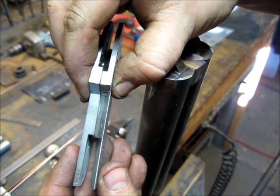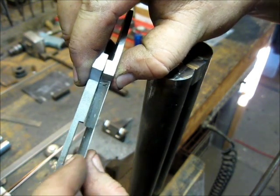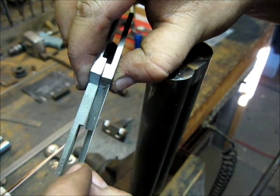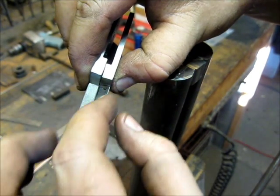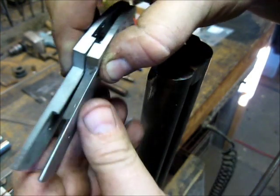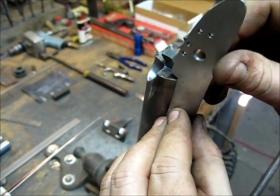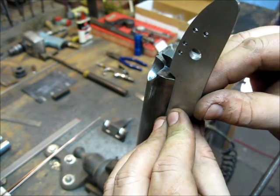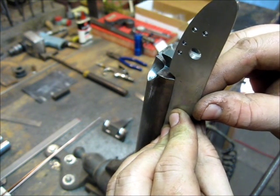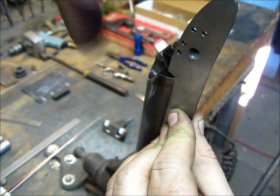And when I put it together this way, you'll notice that I radiused this inside off and brought it up to, instead of being flat, almost a knife edge. It's got just a little flat on the surface so that it's not sharp, but it's radiused off to match the contour of the barrel. That way I don't need a drip bar to fill in the gap. I can tuck the lock underneath and it fits nice and tight along this edge with no gap in it.